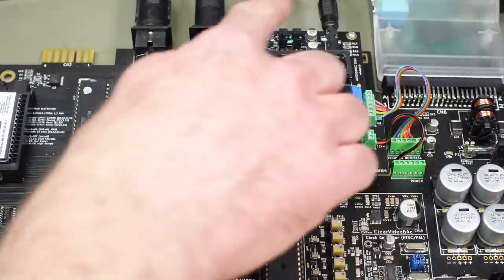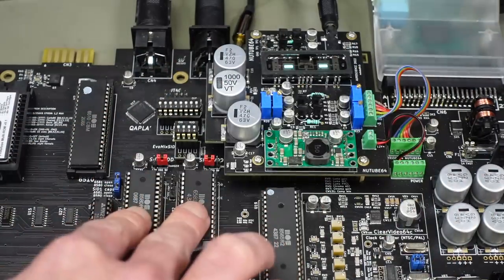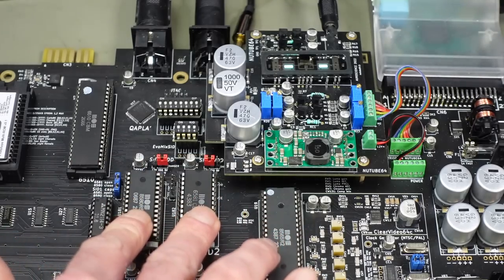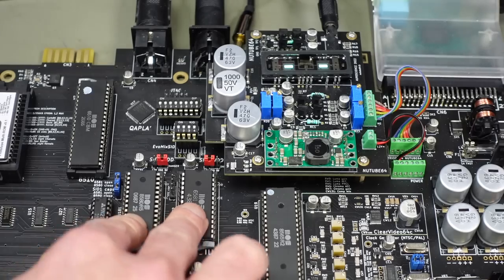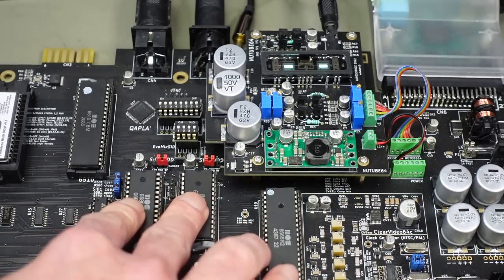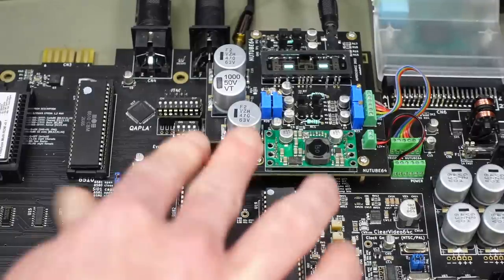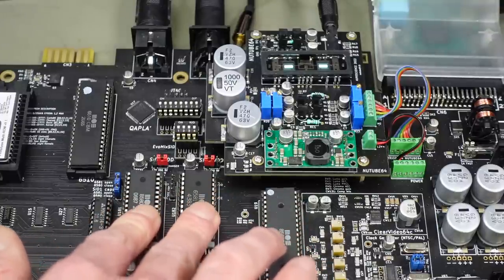And also we have this beautiful thing. In the standard configuration without this preamp module, you can already set different preamp values for both these SIDs. So you can accommodate for differences in volume and things. There's potentiometers under this preamp board that I won't remove at this point because it is set up as it should and screwed down on the board, which is quite solid, so I'm not going to mess with that. But trust me, there are little potentiometers that you can set according to your taste or to rectify volume differences between different SID models on the output.